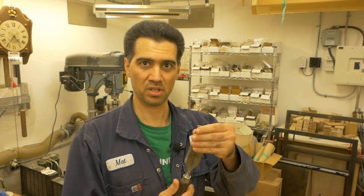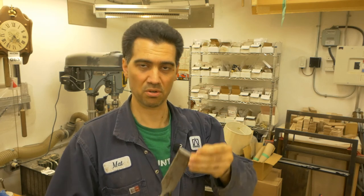For other glues such as epoxies or other two-part resins, I wait for the glue to completely dry and then take my chisel and remove the squeeze out. If I do it any earlier, the epoxy may still be sticky and that stickiness will get transferred to my tool, and as I glide it on the surface of the wood I may transfer more glue to areas I don't want. So for epoxies, wait for the glue to dry completely. For water-based wood glues, wait until the surface is dry to the touch but still squishy on the squeeze out, then take the chisel and remove it.